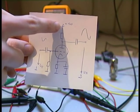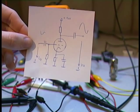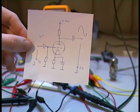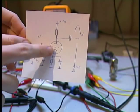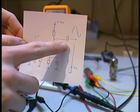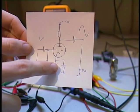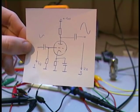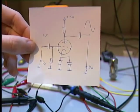This resistor must take a voltage drop of about half of the operating voltage. If the operating voltage is 10V in my case, this resistor must take a voltage drop of about 4.5V. The other resistor must take a lower voltage drop, and the rest of the voltage must appear here, so that we have 4.5V and 4.5V — a symmetrical output. This capacitor is for decoupling the DC offset, and this bypass capacitor is really important for getting maximum amplification, because we are shorting out the cathode resistor. The amplification is calculated by output voltage divided by input voltage.